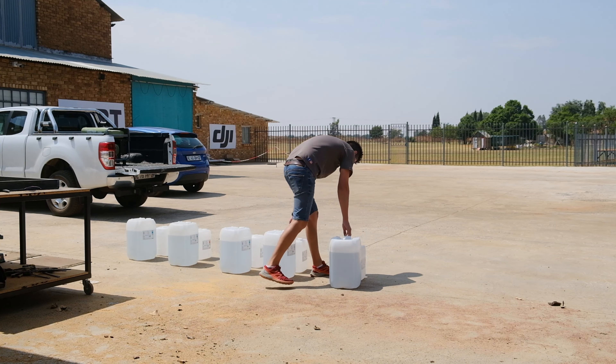Another big tip: once you're done pouring your epoxy, we typically leave the table for around 20 to 25 minutes, then come with a gas torch and pop most of the air bubbles.